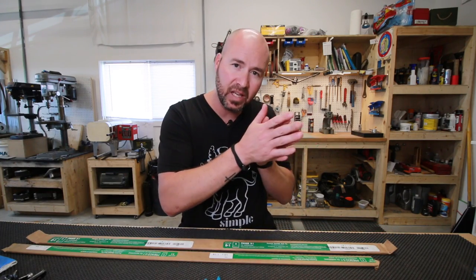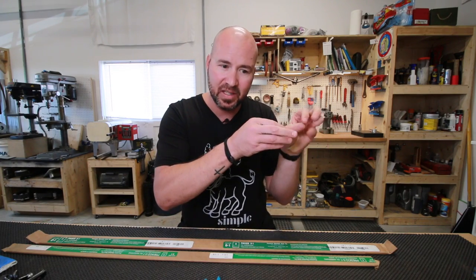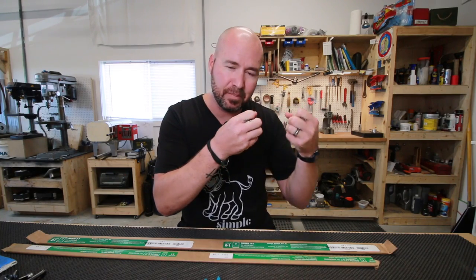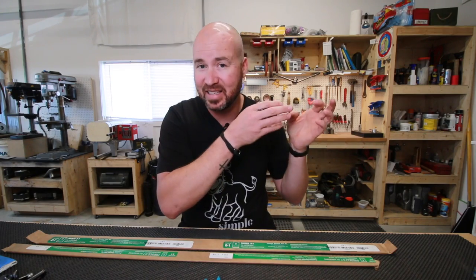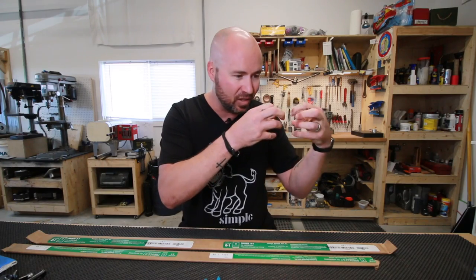So when you're at the austenite temperature, that carbon, instead of being kind of evenly distributed and diffused within the steel, it's kind of separating itself out. It's kind of pulling away from the other ones. It's kind of grouping together and its personality is kind of being shown. That's kind of what happens at the austenizing temperature. That's the austenite state of a steel. And so the carbons are separated, the little carbides are separated and they're all like this.